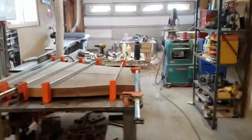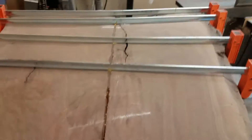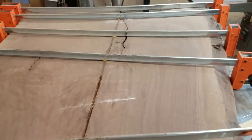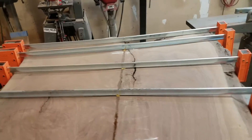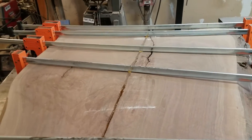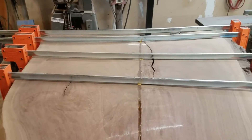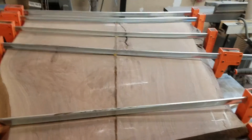Here is a walnut live edge coffee table that I just glued up yesterday. This actually started out as one piece of wood. What happened is it had a big cup in the center of the slab when it dried — that happens sometimes — and there's a flaw on the bottom that I think created a lot of tension while drying, kind of like a knot underneath. Rather than just accepting the cup and flattening it on the router sled and losing a bunch of thickness, I treat those slabs more like a bookmatch dining table.